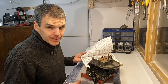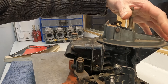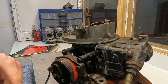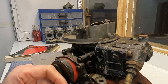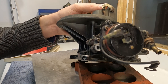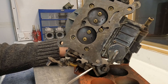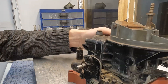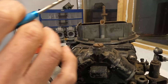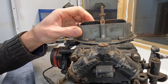This carb is clearly marine — look at the linkage. Let me show you a bit closer why I'm puzzled. The linkage is definitely marine, this bit of paint here suggests it's a marine carb, and all marine carbs generally tend to have electric chokes. Unfortunately this one is broken, so the choke body will need to be replaced. This is clearly a marine shaft. The problem is, as I said, it hasn't got a J-pipe, and it shows list 4412.